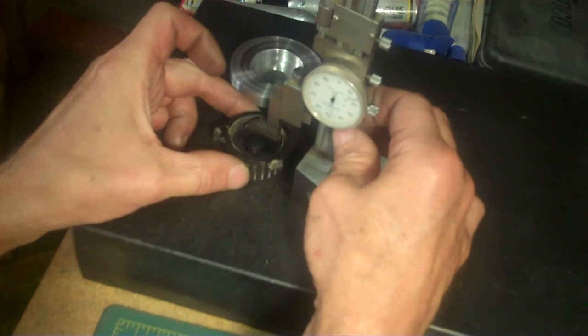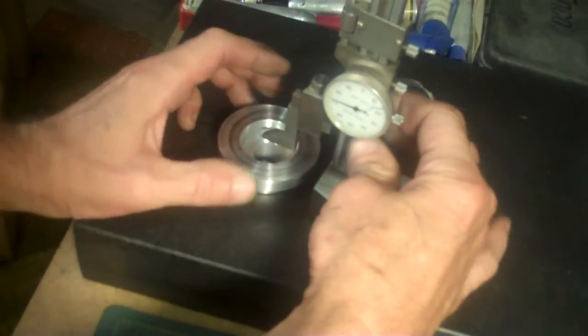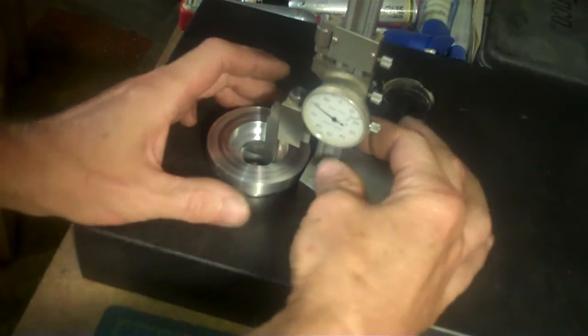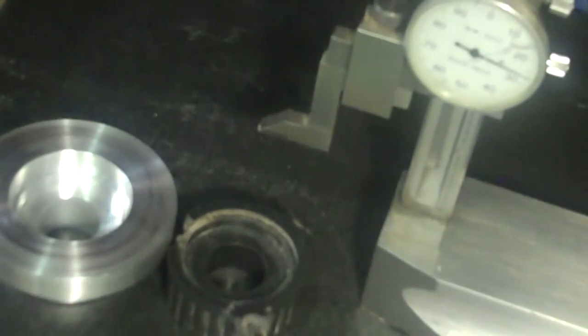This will verify everything. Okay. If I bring this down to the internal bore, I'm looking at 578 thousandths of an inch. If I bring this over and drop this down into the internal bore, I'm getting 579 thousandths. Let me zoom in here a little bit. Okay. So I'm taking the internal bore with both faces down to the surface plate. I'm looking at about 579, and this comes down about 577, 78. So I know now that they are both registering together and both bores are at the same depth in relation to the surface plate. And that's the good verification right there.